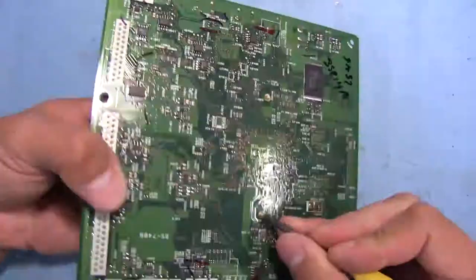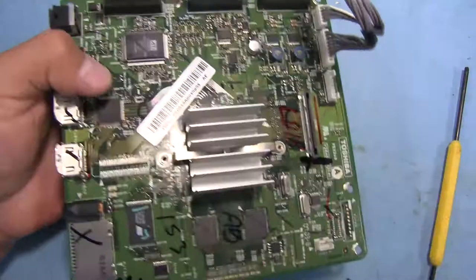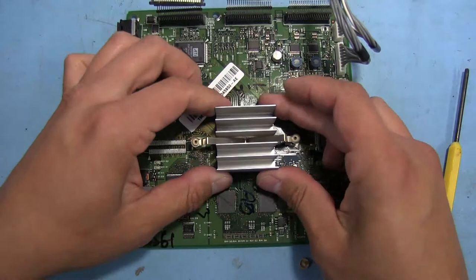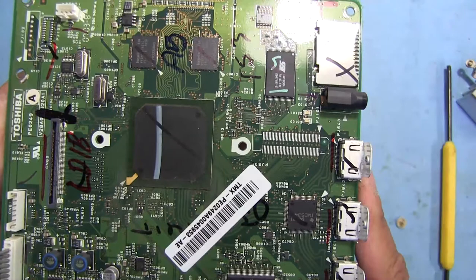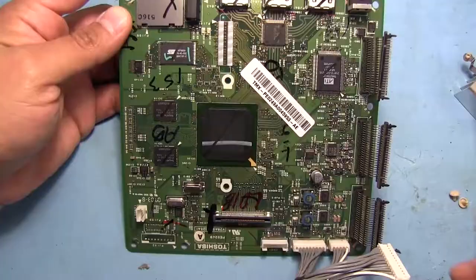Let's push these out carefully so we don't break anything. Let's pull this off there — so now this should allow these to come right up. That loosens that up — let's see if this moves. Okay, it looks like they're using some sort of thermal interface pad underneath. And that's exactly what it is. No surprises — it's a Toshiba chip, and that is a TC90412XBG. Let's look that up and see what sort of description we get.